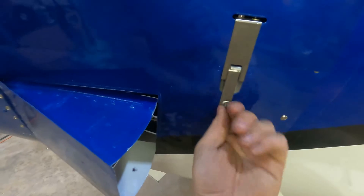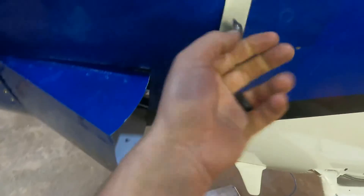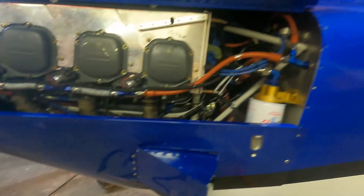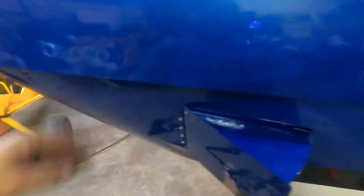What I've got is these Piper latches, one at the front and one at the rear, and they run these Skybolts quarter turns. So you just turn it, the latch pops open, and then you're able to open it and check out the whole engine from there. You can get in here, do oil changes, do everything you need from this side. That's the main gist on the cowl doors.